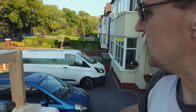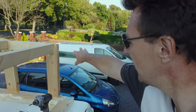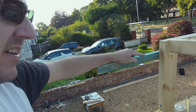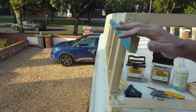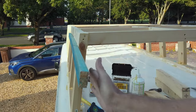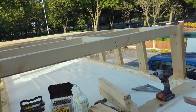So I've got these two mounted now, and yeah, this one's 105 to there. So that'll be directly across to this one over here. And this one to here is 95. So yeah, this one does push out a little bit more. But those two lines now are pretty much level to each other compared to the roof, and they're running the line near enough. So I can then start thinking about where I'm going to have this back section here.